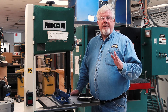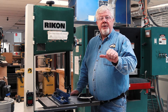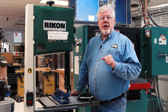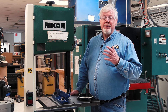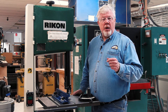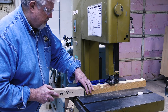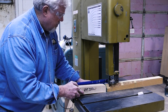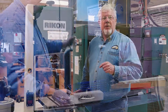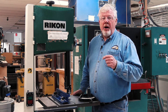Keep your fingers and hands away from the path of the blade. Never use your thumbs to push your workpiece toward the blade, even if you're pushing from many inches away. Hidden voids in your material may suddenly cause the wood to jump forward through the blade at seeming lightning speed, causing serious injury or amputation. When you're cutting small or short stock, use push sticks, feather boards, or other appropriate safety devices to control the workpiece as you make your cut. Do not force a cut — allow the blade to dictate the rate of cutting. Forcing a cut can and will probably break the blade on the bandsaw.